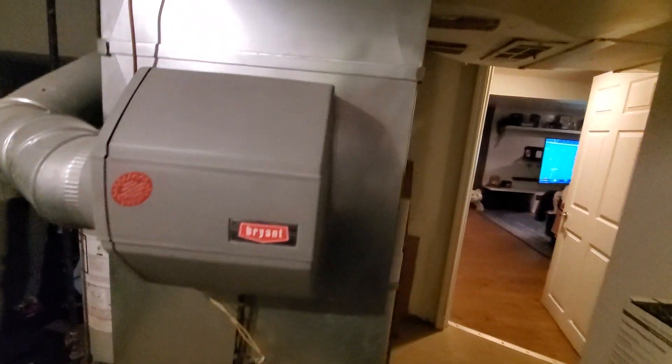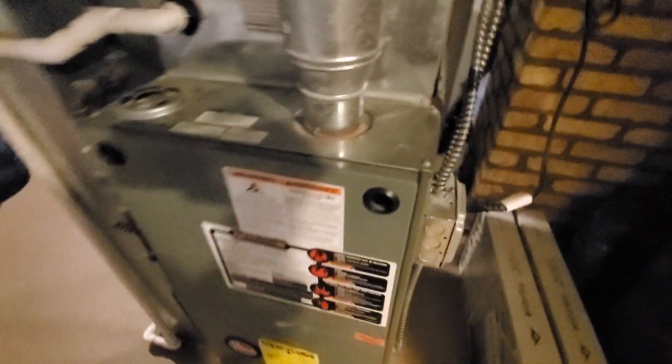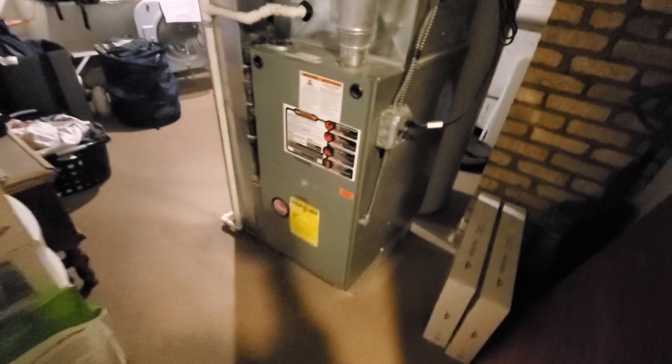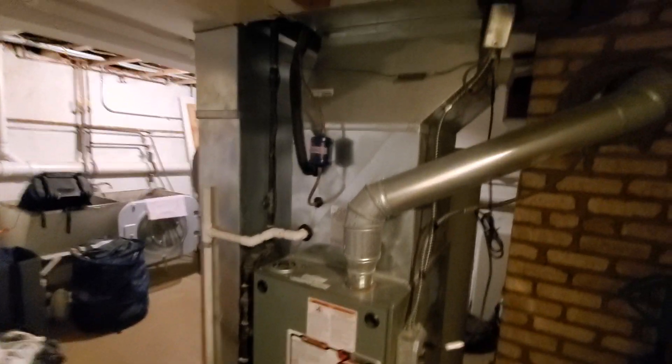Just one of the rotaries on the ductwork here, please. From there, AC sits outside right next to the, right basically on the driveway, and we are going to be replacing the thermostat and going with an Ecobee with the sensor, so we do need to install that wireless sensor.